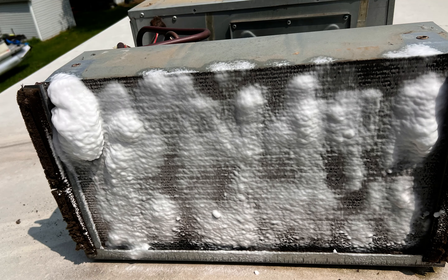You can hire somebody. Basically you use a coil cleaner that's a no-rinse and there's a little scrub brush that comes with it. You're going to take the shroud off of the air conditioner on top of the roof, spray the coils, clean it with that scrub brush, and also make sure there aren't any coils that are bent or smashed down because that can cause the air conditioner not to run efficiently. You also want to make sure you're cleaning the filters out, because it gets dirty and prevents it from working correctly, and when you get to summer you want that air conditioner working properly.